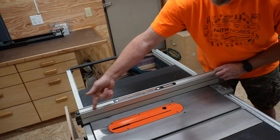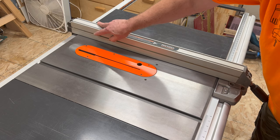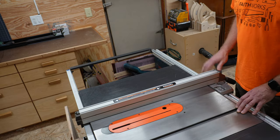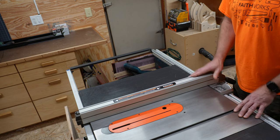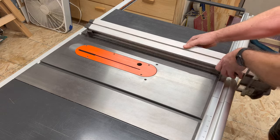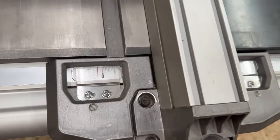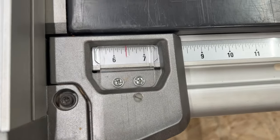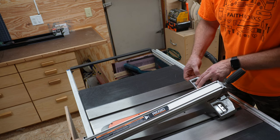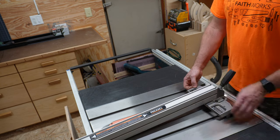Another feature of this fence is T-track on the top — there are two grooves on top and one on each side for putting jigs and clamps and things like that; you can use a quarter-twenty bolt or a toilet bowl bolt. I do think they've made improvements to the newer fence with how it locks on, but I don't have those details. The fence itself is flat — I haven't had any issues there. It has clear view windows to see the rule on the fence, but I only use those for approximation. I actually take my measurements from the blade to the fence rather than relying on the rail scale.